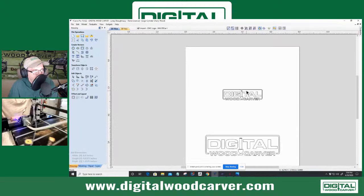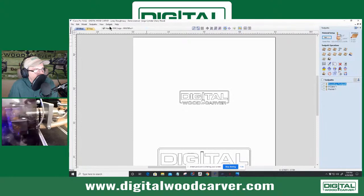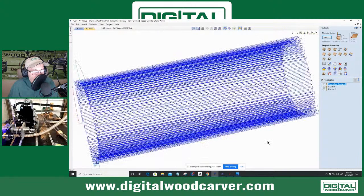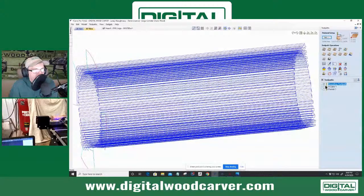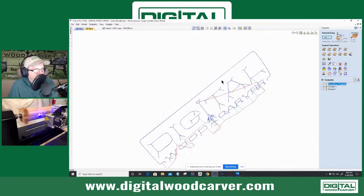Now, if we go over and look at the toolpaths, there's absolutely a rounding toolpath. This toolpath comes through and knocks off the corners of the cylinder, and that's what Burl was running a moment ago with the router bit. He was knocking off those corners to round that stock. And then we have our V-carve toolpath, which is funky when it's wrapped here. Let me unwrap it there.